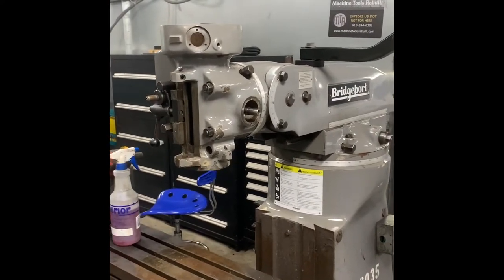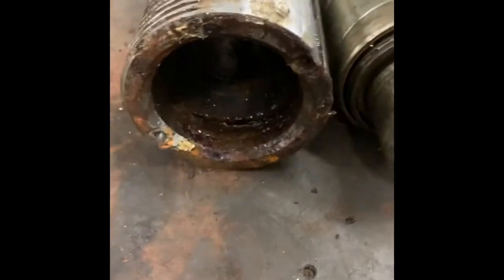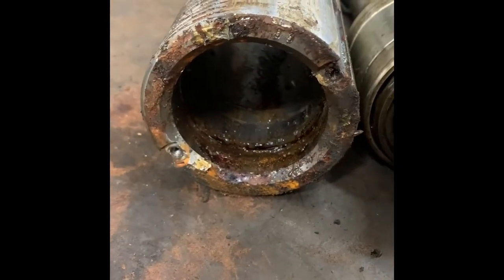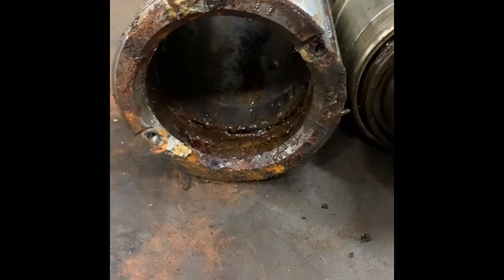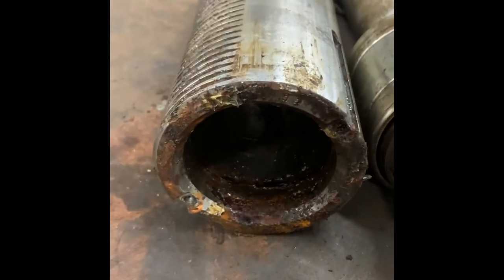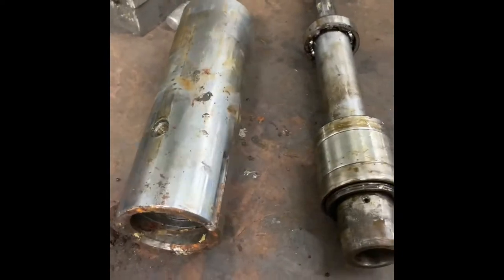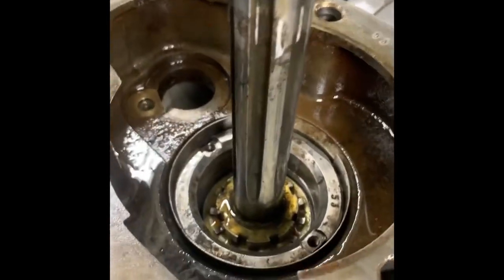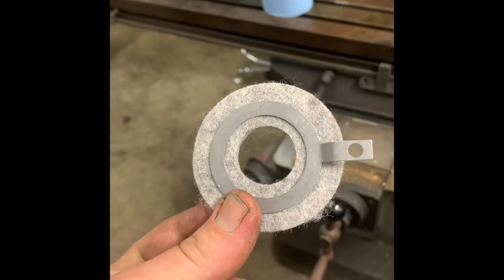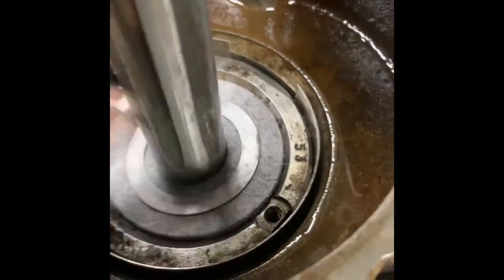The lower housing is all cleaned up, as is everything above the turret. I wanted to show you the spindle real quick. This is the so-called fully functional machine I bought from a dealer — this spindle is full of water. So the term 'functional,' I guess each person has their own definition, but this to me is not functional. So we're going to address this. The spindle's all rebuilt. It gets a felt wiper in the top, and the oil drips onto this felt wiper. It screws down like so.